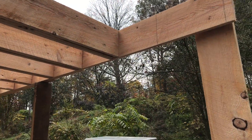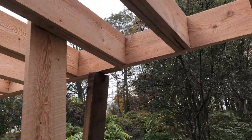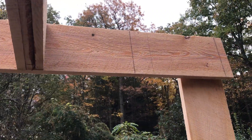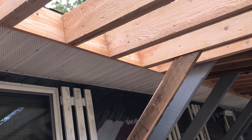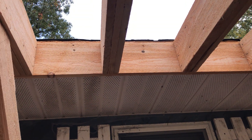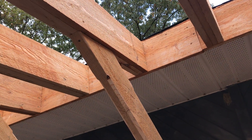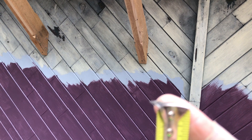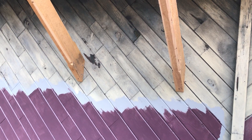We just did a check on whether we're running on one side. What I mean by that is: let's say person A measures one side and puts the marks in, and person B does the other side. You have different tape measures, and the end of the tape measure can make a little bit of difference. This end is supposed to move depending on whether you're pushing against something or pulling, so that could make a slight difference.